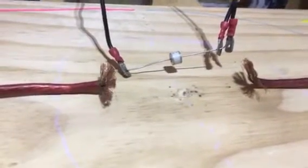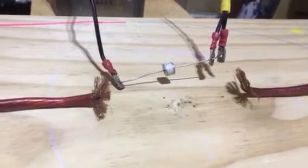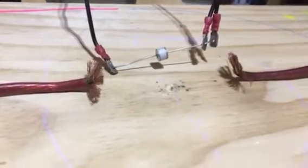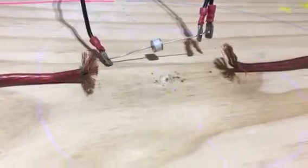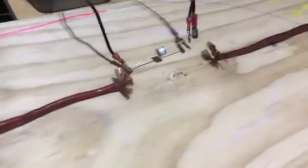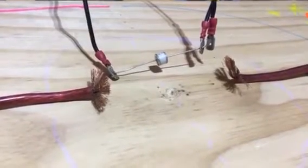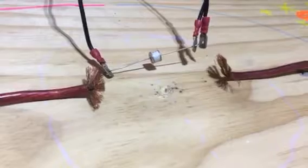I don't know if you can get a very large capacitance in the UF range which will be able to take that charge and discharge it really quickly. I'll have to see about getting one of those larger caps. I'll try that 120UF cap that's rated at 3,000 volts and see what that does — it probably goes even slower, more like the 50UF I had in there.